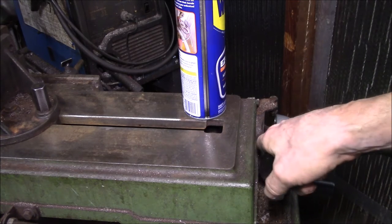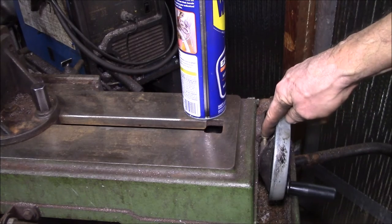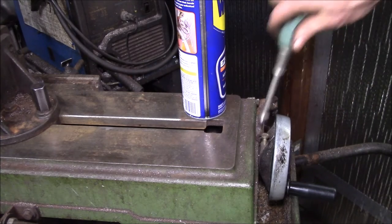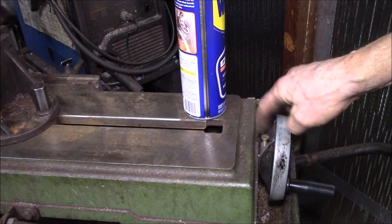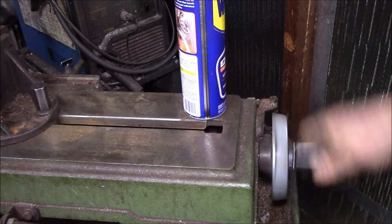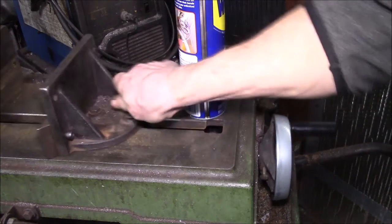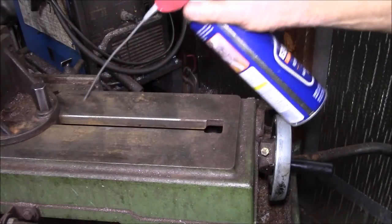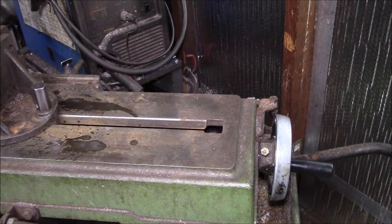The other thing I have to do is tighten up this lock screw. I had to replace this at one time because the hole stripped out, so I re-threaded it for a quarter-inch coarse thread bolt — that seems to grab pretty well. I think there was a set screw in there originally and it stripped out. Usually give that a shot of oil too.